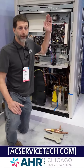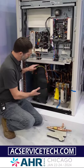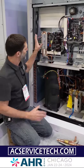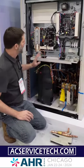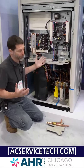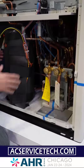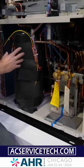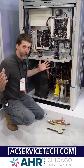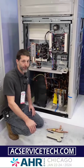You can have upwards of 3,000 linear feet of line set length and go up to almost 300 feet vertically — that's a really big deal. The compressor is an inverter compressor, and on these smaller systems you're going to have one compressor with one IPM — an intelligent power module — along with a refrigerant heat exchanger to power the compressor. This right here is your heat sink, so you don't have to have air crossing the heat exchanger of the IPM. In the back there's a huge accumulator — as big as the compressor itself — because it can connect to so many different indoor units. This is for large commercial applications, but you can get as small as a six-ton VRF connected to three-phase power.